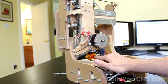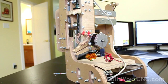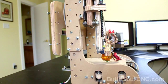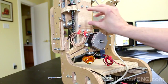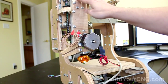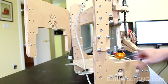We should have the new generation 4 hotend assembled and installed. The first thing we will be putting on is the main board, which is the Arduino Mega. I'm going to be placing it somewhere in this location so it can access the power supply easily. The extruder controller will be mounted in this location, and the stepping motor controller for this stepping motor will be mounted here as well. The X motor controller will be situated underneath, and the Y-axis motor controller will be somewhere in the rear of the machine, as well as the Z-axis.